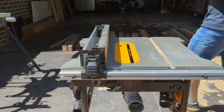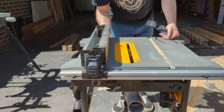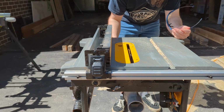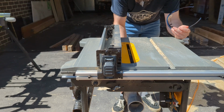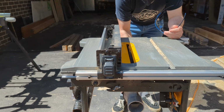Alright, so now that we have a straight edge on all the pallet boards, we now need to cut them down to a consistent thickness. I've worked out that with all these random boards, we can get a minimum of 2 full strips of each at 40mm. In freedom units, that's about a quarter of an eagle. Then, once that's done, we'll give them a quick plane to give us nice contact edges ready for a glue up.